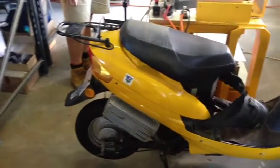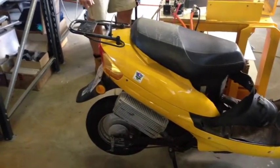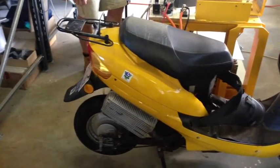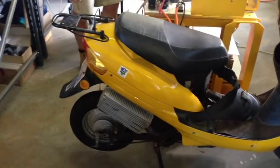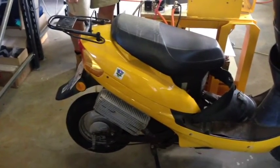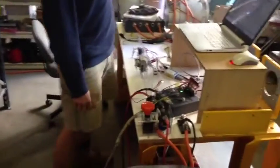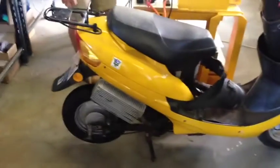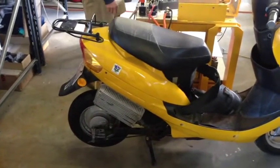We've got the wheel turning, and this is just a little demo of field weakening, which is when you put a bit of negative ID into the motor. It actually weakens the back EMF and allows the motor to run faster. The first demonstration is going to be Craig setting the field weakening off, so the motor will just run at what's called its base speed at 48 volt.